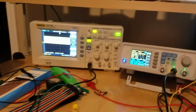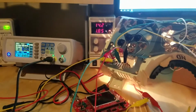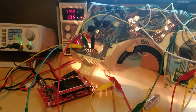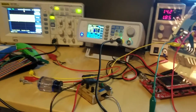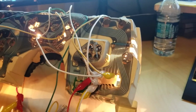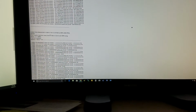and there were some threads I came across online that helped me a little bit with some of the math as far as tire size and all that, and trying to calculate based on drive shaft revolutions and all that good stuff on what the sensor is going to send to the PCM. But regardless, if you kind of know what the cluster has to input, which is 4,000 pulses per mile in this case, then this is the kind of math you're going to need.